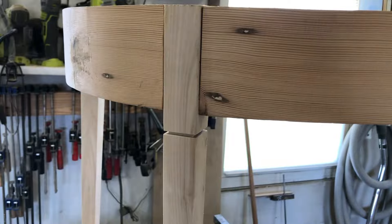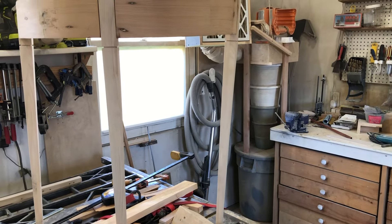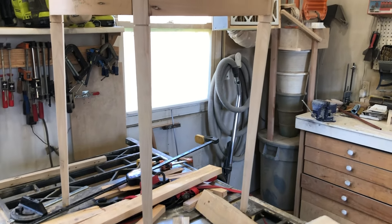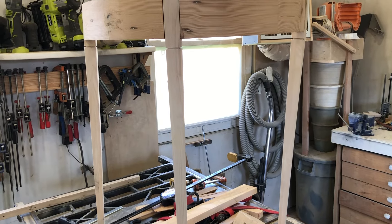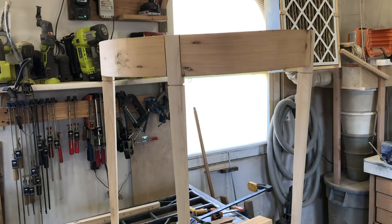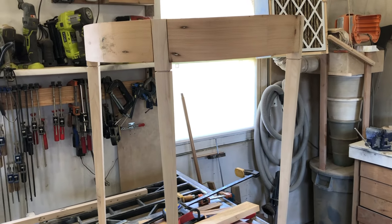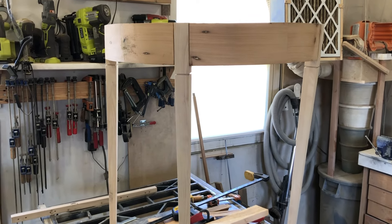I could theoretically fill that in with some wood filler because this is a painted piece, but I just don't like it. So this one is a complete disaster. You can see how far out we are, and if you look at that leg, it just tilts in way beyond what could be repaired. Frustrating, but it's all a learning experience — tried a method, didn't work. Not that dowels are bad things, but perhaps my implementation here wasn't as good as it could be. So I'm going to look at a different way to assemble this. Right now I'm thinking of a floating tenon, but I'm going to consider other ways to join these. Short term I'm going to wind up tearing this apart, taking the legs away from the face, and we'll try another tack.